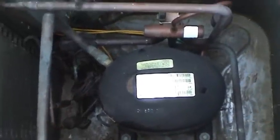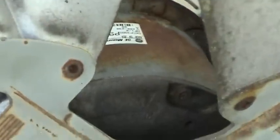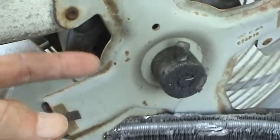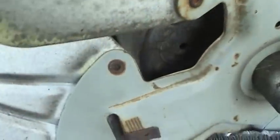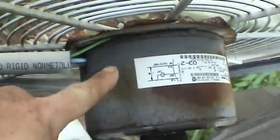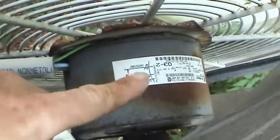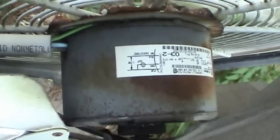The way this unit's running, it's running very well. The only things that are going to happen are the accumulator going bad and the original condenser fan motor bearings failing. The motor is in great shape — as you can see, it's losing some of the oil, which is perfectly normal as the oil gravity-feeds down over time at higher temperatures, eventually leaks out and dries up, and the bearings will seize. This motor does not have any provisions for lubrication. You can take these things apart — there's a little wick inside the front and rear bearing — and you can re-lubricate them. The problem is getting it back together in such a way that the shaft isn't at an angle creating friction. So these are pretty much a single-use type motor, but it's already lasted 20 years and there's no reason why it won't last a few more.